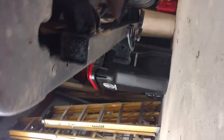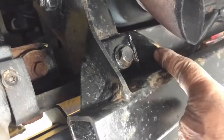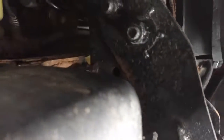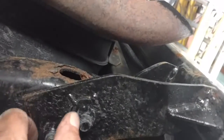So much for that — all the fuel regulators I saw were up on the fuel rail. On to my trailer hitch: I bought some three-sixteenths wall two-inch pipe and made a little L-bracket on each side, cut it to the length I wanted, then spot welded it. I got it where I wanted it and put a gusset on the side right there to give it extra strength so it wouldn't bend down.